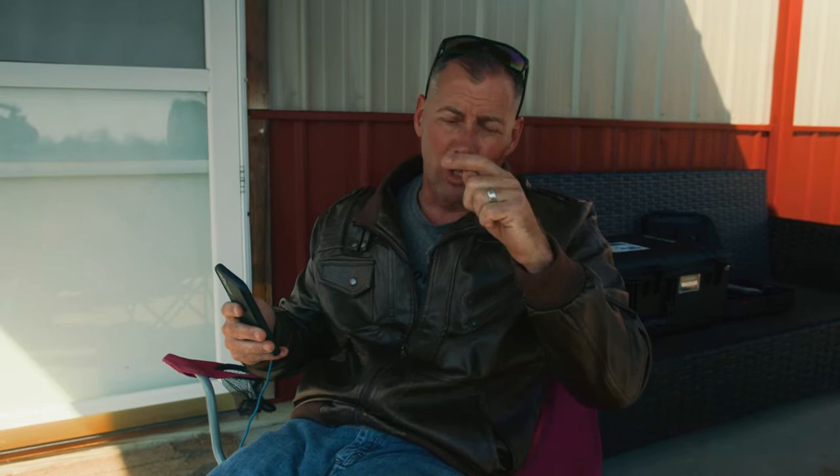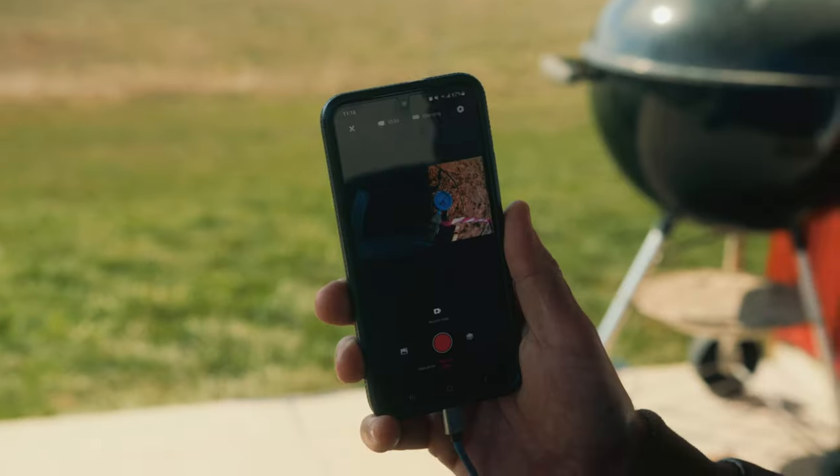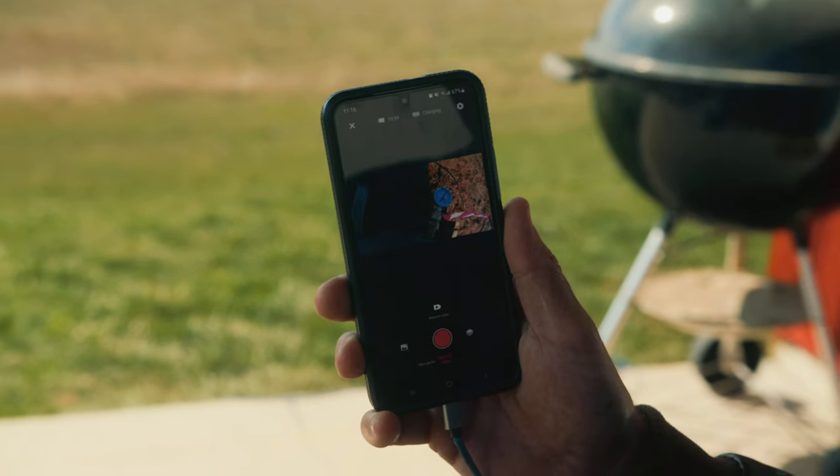What I expect to happen is pressure is going to build to a point and then either blow the bottom dome completely off, or start flipping and distorting the dome. When that happens, pressure might level off or actually drop — if that dome pops and there's more volume in the tank, pressure would probably drop pretty sharply. Currently, we are closing in on about 180 pounds of pressure already, and it's been heating for less than 30 minutes.